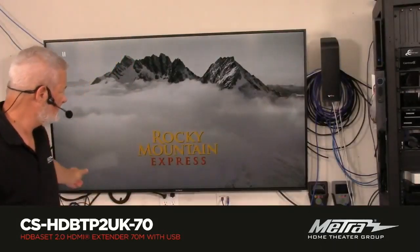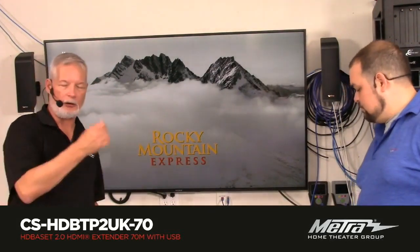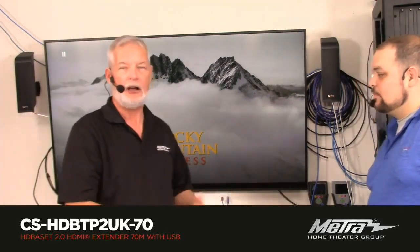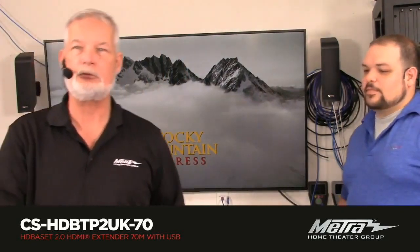So you get a smoothing of the picture, more colors, more available options for the TV to pick data from. Now, one of the things you don't have to worry about with HDBaseT is refresh lag, so your audio and your video will match. Unlike IP systems, this syncs up properly. So that's a great way to go to maintain audio and video together.